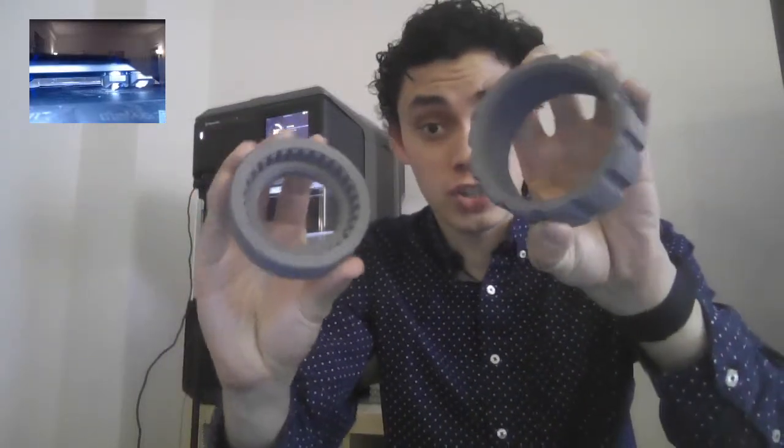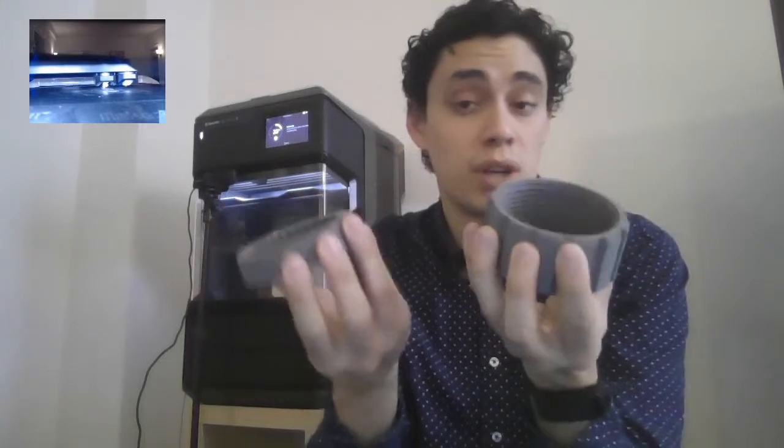Like you can see this gear. I got some interesting parts that I printed so far that are not sintered yet. So these two are still green parts that I need to send out to be sintered. Next up, you will need to consider that you're using neither supports nor raft. You will need to either design your own supports or trust that any supports will be able to hold their own weight once they run through the sintering process.